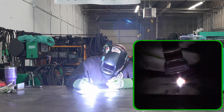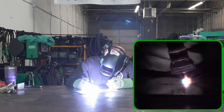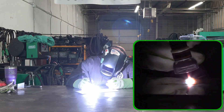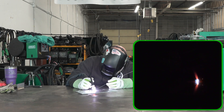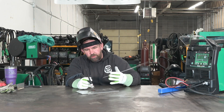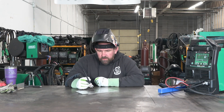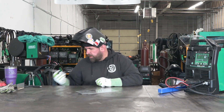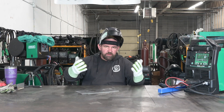We're going to taper all the way down, so we're at our 10 amp minimum. We'll just let it sit there for a second, then ramp back up. Hood took a second to adjust. Then we taper back down, give a little dash of filler — real smooth taper all the way down to our minimum amperage. That's what you want to see out of a good DC TIG machine: 10 amp minimum, maintaining a nice stable arc.